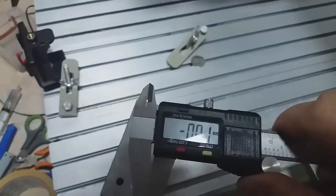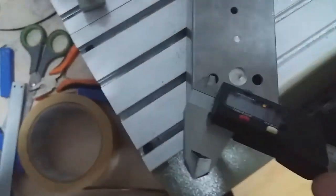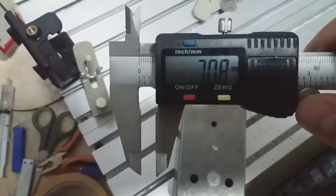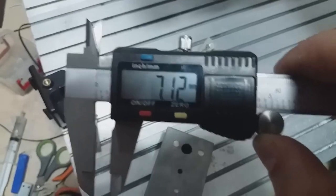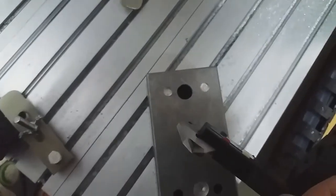Now let's see the results. I'm going to zero in everything. So I'm going to measure here — just 7.09, but let's see. I'm doing this with one hand, so it's kind of tricky. This is more like it — it's 7.12. 7.12 millimeters from the 7.2 millimeter advertised dimension. This one is 7.15, but again, I'm doing it one-handed, so that will have some influence.